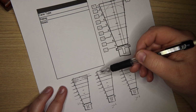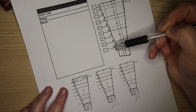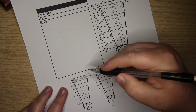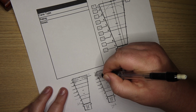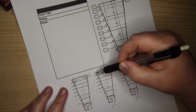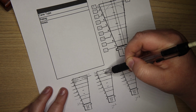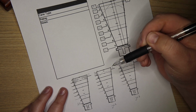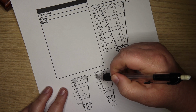You can always take off more cane later if you feel like the tip isn't very responsive. This is where we're really going to start to put in all of these tick marks, pretty much like this finished thing here. So the first tick mark, 15. Remember, this first tick mark is a halfway mark between the tip and the first actual tick mark on the dial indicator. Again, this is in imperial. If you're in metric, you're going to have to convert these. The third one should be 21.